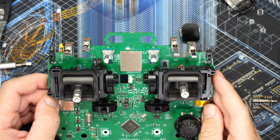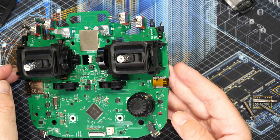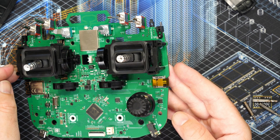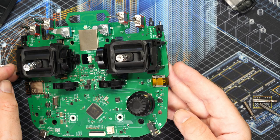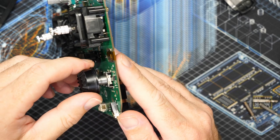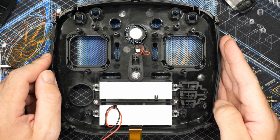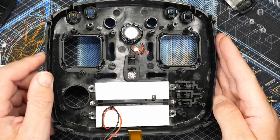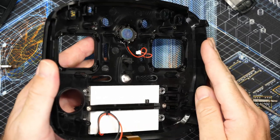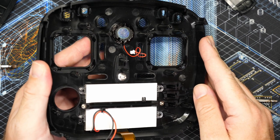Looking at the top of the radio PCB you'll find the built-in antenna for the Tracer module, and below this is a UFL connector allowing you to fit an external antenna. The SD card is located on the inside, held in place under some tape on the right hand side of the PCB — not easily accessible externally but it is there. The rotary encoder is located just below this on the board. The LCD screen is mounted directly to the front panel, and the power button is a push-to-make button directly on the PCB, actioned by pressing the front button with a very small lever movement.